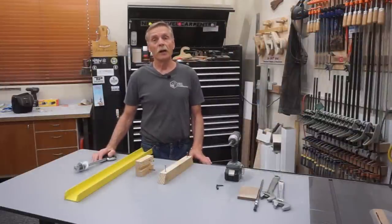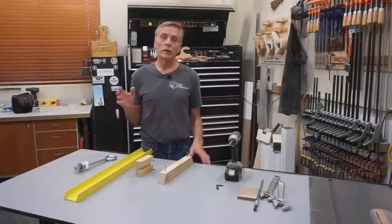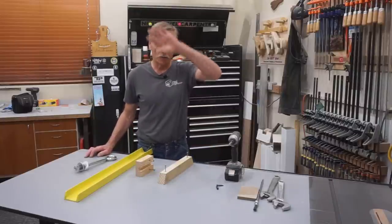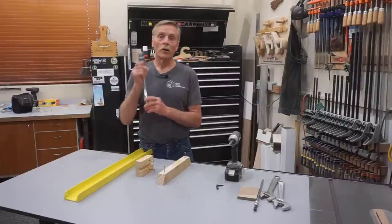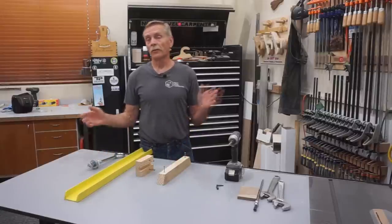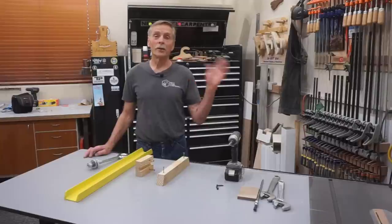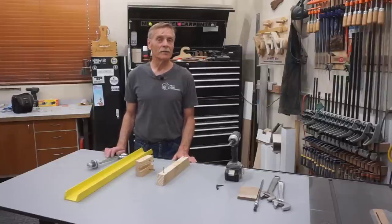Because I'm neither a lawyer nor an engineer, I'm not offering guidance or advice for skyhooks in any other applications. But I hope you'll see that with a little engineering and some forethought, having a functional skyhook in your shop is a real possibility. I've got years of experience in the building and construction trades, so I understand the nature of the structure above the ceiling here in the shop, and I'm confident in its strength — I'm comfortable with a working strength of 500 pounds. Anyone lacking experience can consult an engineer and come up with a safe and reliable design.